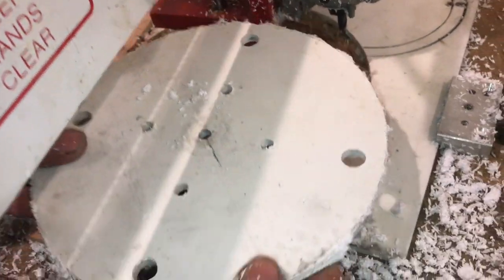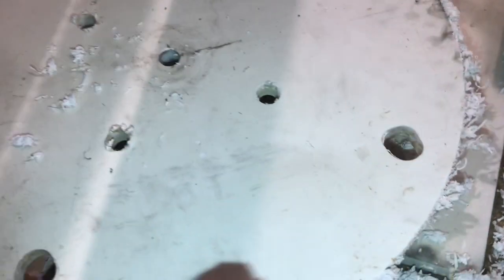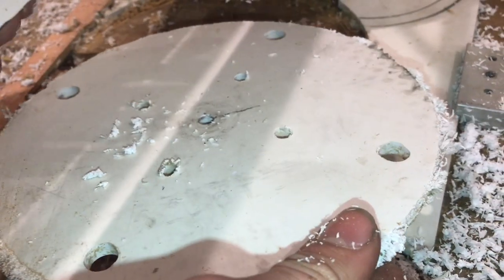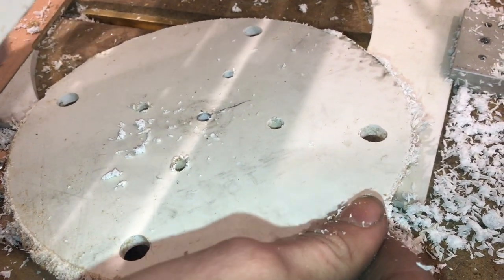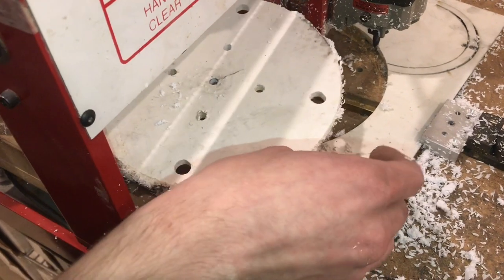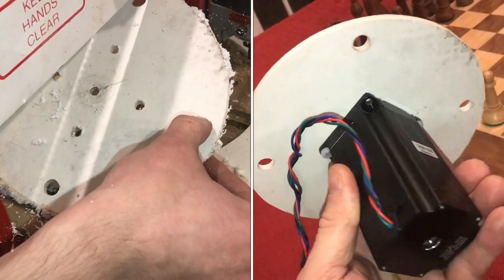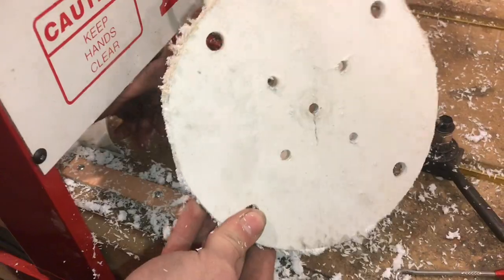The next thing I'm going to look at is my holes. Some of the holes don't look too bad — that one is almost completely circular. However, take a look at these two, especially this one. Look how flat that is. There must be something, maybe a piece of dirt or some chips on my X or Y lead screws. They probably are not very clean. I've cleaned them in the past and that seemed to help. That's not terrible — well, it is terrible — but I can clean it up with a drill bit. Anyway, that's what I'm doing tonight. Thanks for watching.